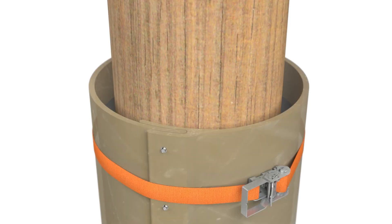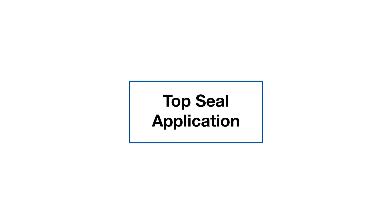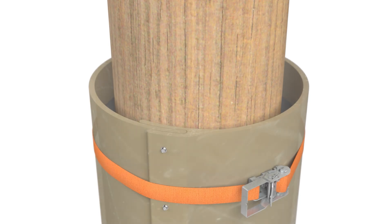For FX-76MP, fill to the top of the jacket. If using FX-225, fill until grout level is 4 inches below the top of the jacket and allow grout to cure. Sealing the top is the next step — for FX-225 applications, a top seal of FX-76MP epoxy must be added. Mix and pour into the remaining 4 inches at the top of the jacket, then leave until cured.